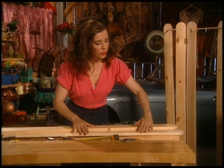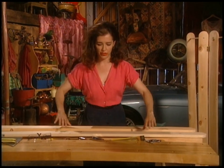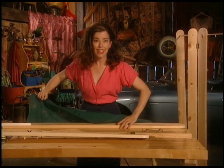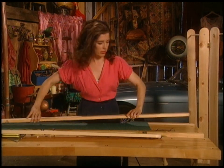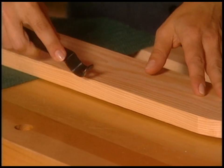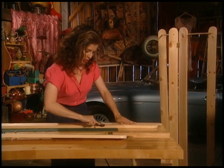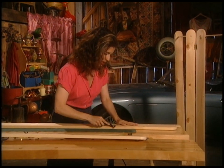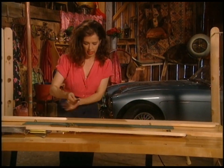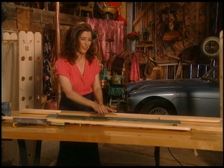Okay — smooth, sharp. You want to make it smooth, and for that you use a cornering tool. It's the most cool little tool. The easiest way to use it — there's a mat that prevents it from moving around, and it's sharp, so watch what happens. Perfect — smooth! Clean it up. The grain of the wood changes as you go down, so sometimes you have to go in the opposite direction. If you go the wrong way it binds; you have to go the other direction because it shouldn't bind. You can change the size of the radius by using the different end of the tool.